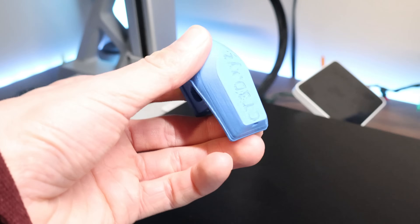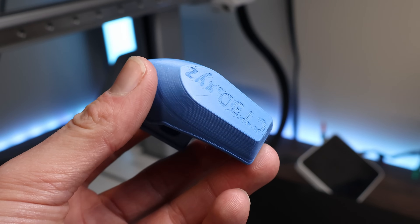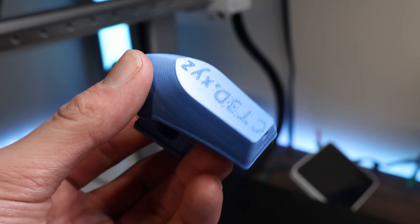If there was a choice between smooth PEI and G10, I believe I would choose the G10, because there's really no need for using glue on this bed at all. Both smooth PEI and G10 have similar bottom surfaces on the prints that are very smooth and shiny. Overall, all these different build plates have tons of strengths and weaknesses. If I had to choose just one build plate to use from now on, I would pick either smooth PEI or G10. Let me know what build plate you use and if you're going to buy any of these and try them out. There will be some affiliate links down below if you want to help support the channel, but this video is not sponsored. Thank you for watching and God bless.